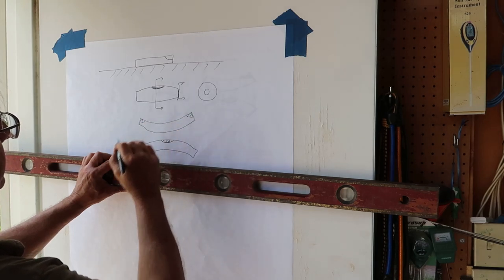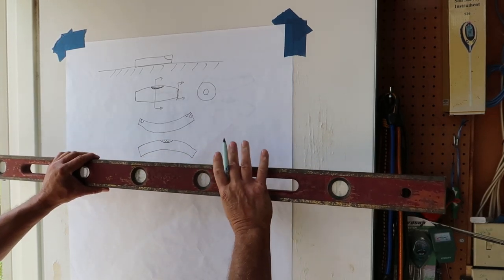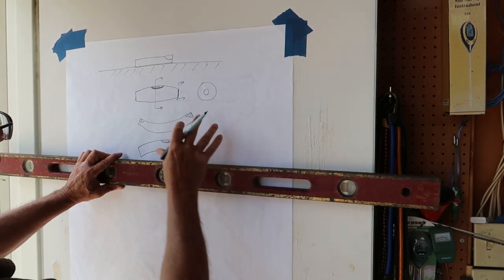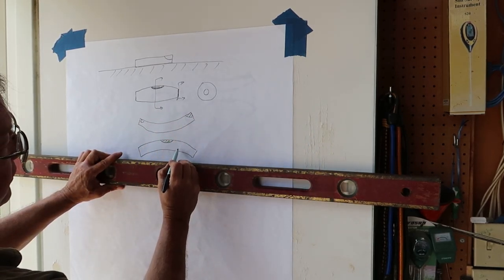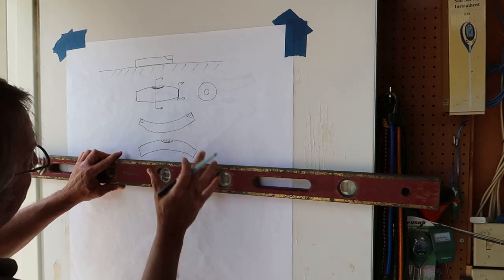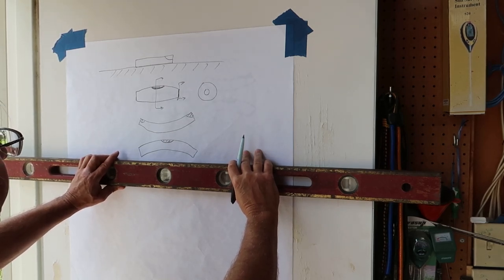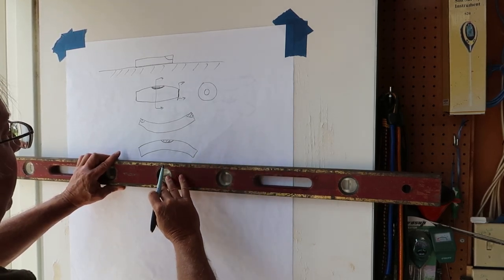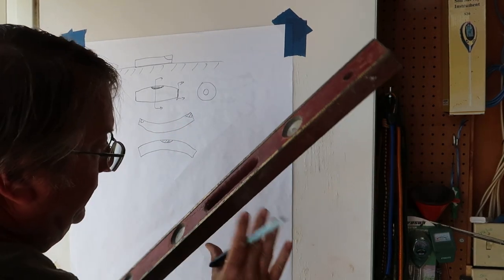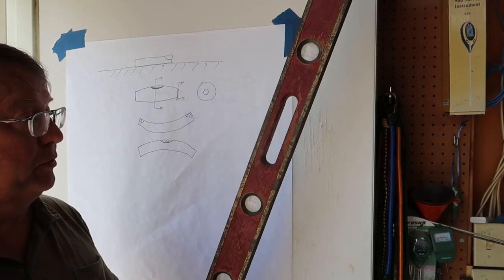Well, why did they make that upper one? Because you don't have to worry about up and down on your level. You just walk up and, hey, I turned it around. Well, it's the same configuration. This was the upper one, and now it's your lower one, and it behaves correctly because the orientation is such that it works. So it's kind of ingenious, and that's why there's two vials here, because they are both curved, if you will.